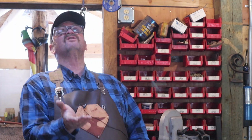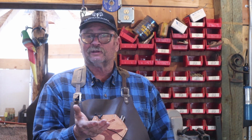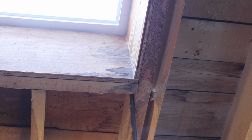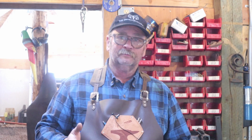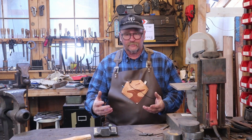For those who have been watching all winter long wondering why doesn't he insulate his shop better, well right here is the reason that my shop isn't insulated as well as I would like it to be. There's a load of snow on the roof and it's melting, and unfortunately it's finding a way in around the skylight right above my head. And until those details are fixed, I don't want to insulate because it'll just soak the insulation and that'll create even bigger problems. Hopefully this summer I'll be able to hire a roofer and we'll get this done right with all new materials.